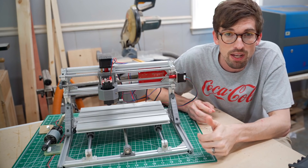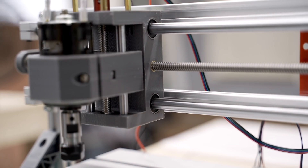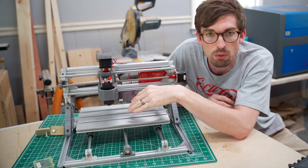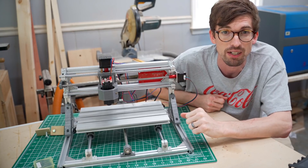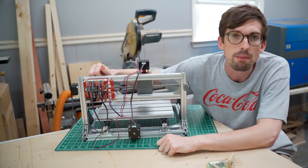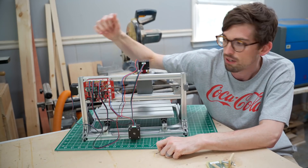A couple of other things — this probably helps keep the price down, but there are actually 3D-printed parts on this. The part holding the threaded rod for the Y-axis is 3D printed, as well as the entire Z-axis assembly that holds both your laser and your CNC spindle. So there's some flex to it, and that was probably the biggest issue overall. You're really not going to do anything super crazy hard with this. The last thing I found a little strange is that the entire motherboard is exposed. Something that would be easy to do is make a little case for it — you could even laser cut or CNC it.